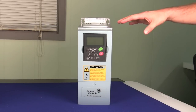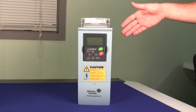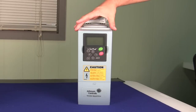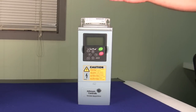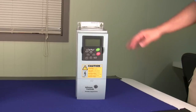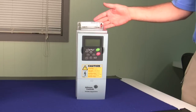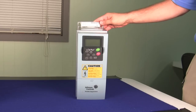This frame size goes from 1 horsepower to 7.5 horsepower in the 480 volt version. The width is approximately 5 inches, the depth is approximately 7 inches, and the height is a mere 12 inches. Though these sizes would be a common variable speed drive in a mechanical room, this particular product offering ranges from 1 horsepower to 250 horsepower at 480 volts as a standard Johnson Controls offering.